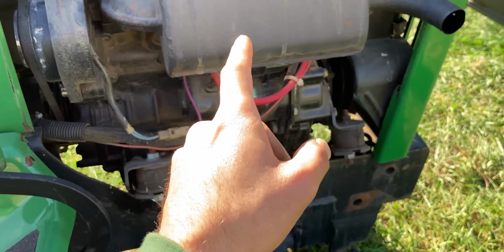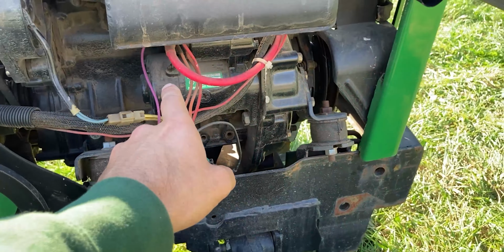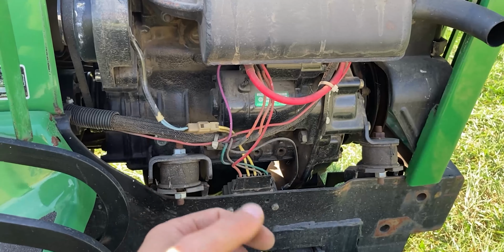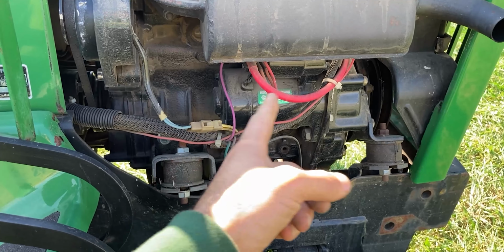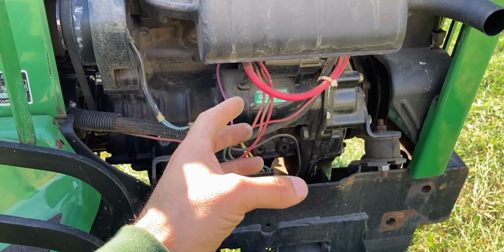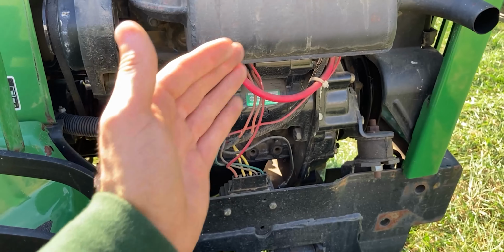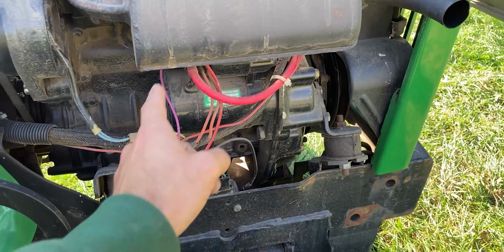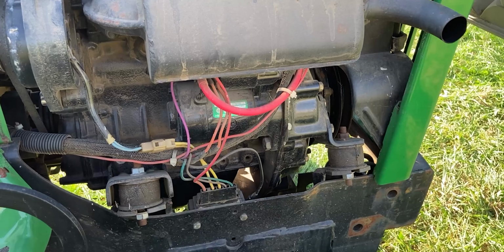Below the alternator and the muffler, you'll also notice your starter. So this is your starter motor right here. If you're having troubles, if it's clicking, you're obviously not getting enough voltage. But if this starter right here doesn't sound well, or it doesn't engage or disengage properly, if you hear even a grinding noise as your engine is running, it might be because of your starter. It's actually not disengaging. So that's another thing you might want to check right there.